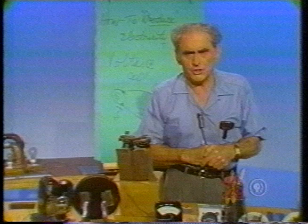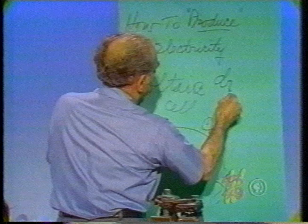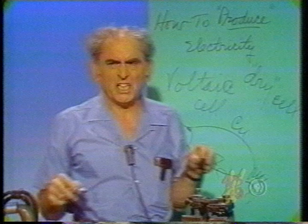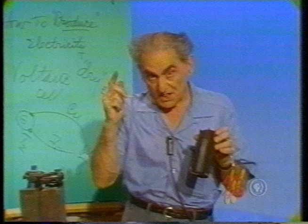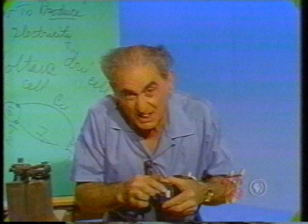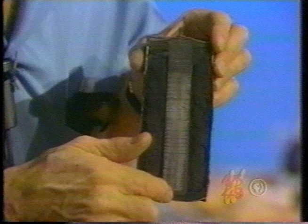Consider a dry cell with which you're all familiar. I put the word 'dry' in quotation marks. Why? The cell is not dry. It has some pasty stuff in it — manganese dioxide and other — which makes it a wet cell, but it's always sealed up tightly on top so as to keep it from oozing out. What constitutes a dry cell? The central pole is carbon, the positive pole, and the can which holds it all together is zinc, and thus do we not have a voltaic cell made up of two different metals.